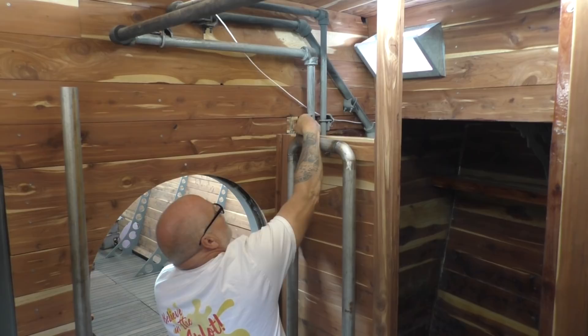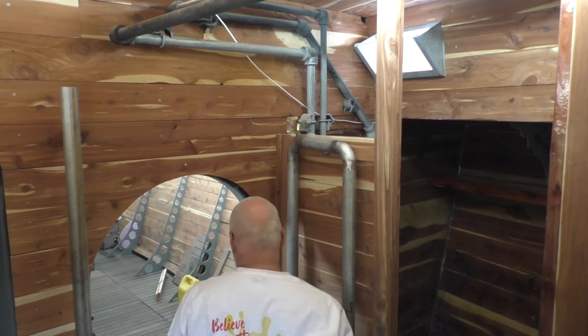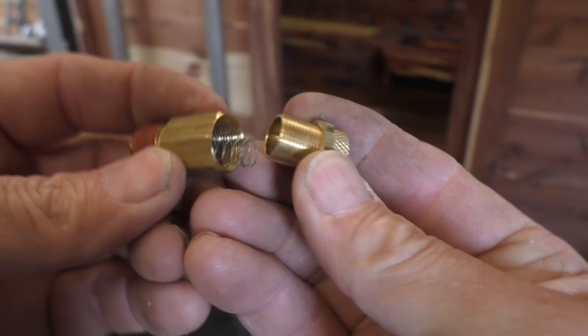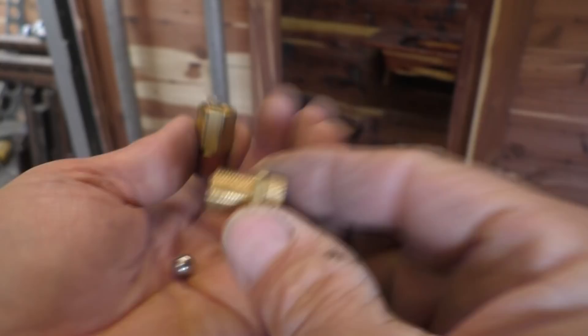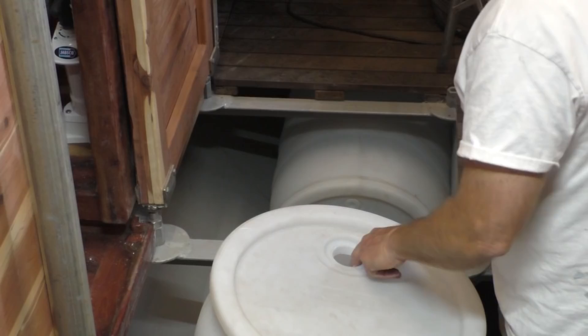A vacuum release valve is one of the parts that came in. It's a simple little gadget — it's just got a spring and a ball bearing in the top. When the air pressure creates a vacuum in here, it pulls the ball bearing back down against the spring, opens it up, and lets the water drain back. So this is now an anti-siphon loop. It's actually adjustable because you can thread this collar down and lock it in so that the spring isn't so tightly compressed. I need the bushing reducer — it's on order.